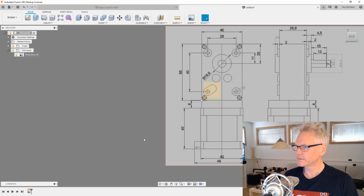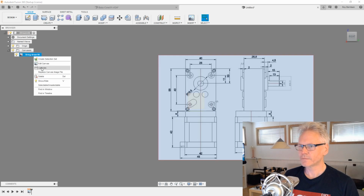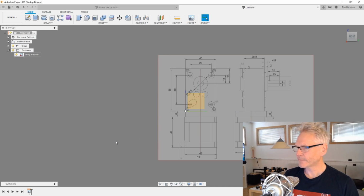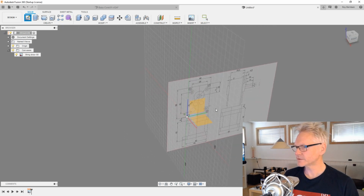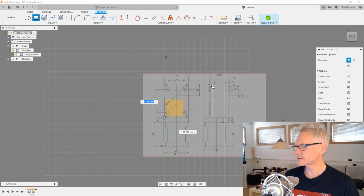It's about okay, because then I can also bring it down a little bit in transparency, opacity, we don't need to be too strong, and we want to display through, and okay. So then start a sketch on the same plane, of course. I'm working on the right plane, and I'm gonna do R for rectangle, and just click the origin